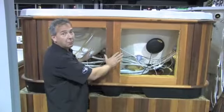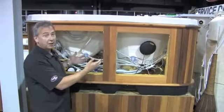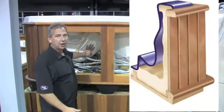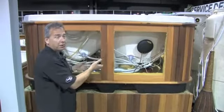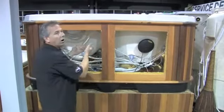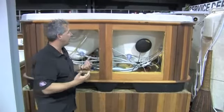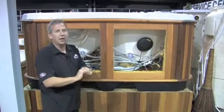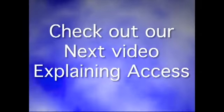To recap: the Heat Lock concept means insulate the perimeter, do not insulate the shell, and let the heat transfer back and forth. There are huge efficiencies from using the equipment's heat to warm the water instead of venting it outside. And if you live in a cold climate, there's a very important freeze protection built right into this spa that will protect you in times of trouble during cold weather.